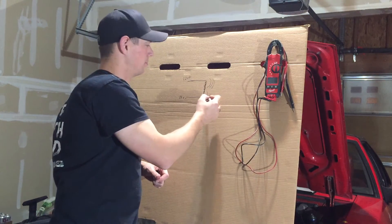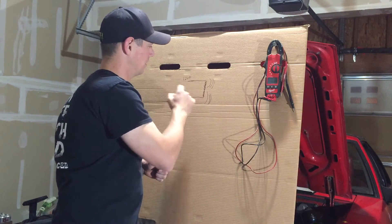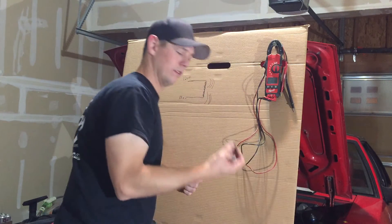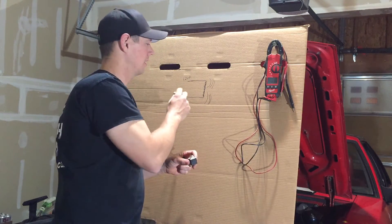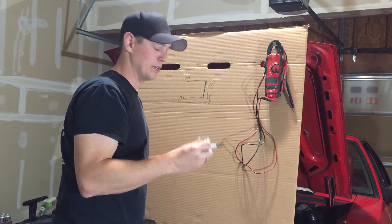It doesn't need much to pull in the coil of a relay. So after you've got this coil, then you've got your other set of contacts. You've got five pins on here, right? Two of them are for your coil — something's going to operate your coil and tell it when it's ready to work. And then the other three pins are going to be your switch.